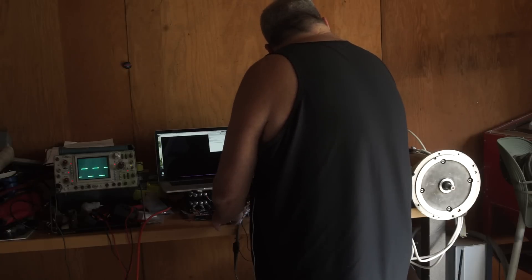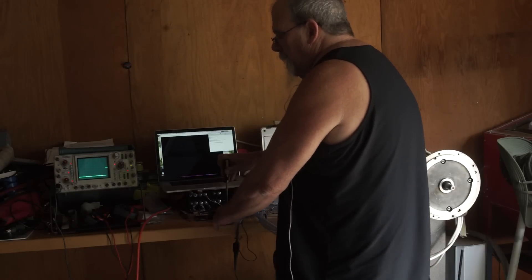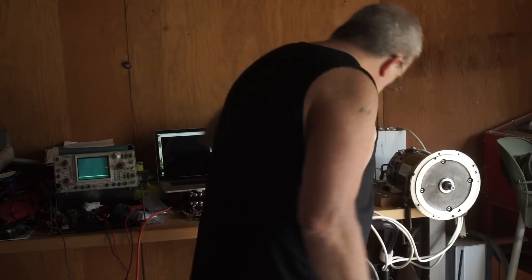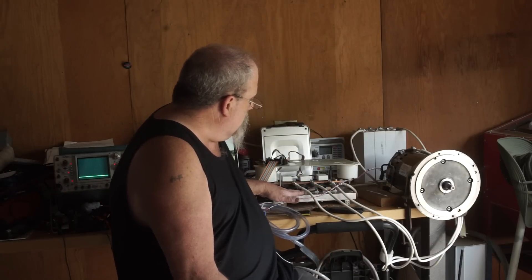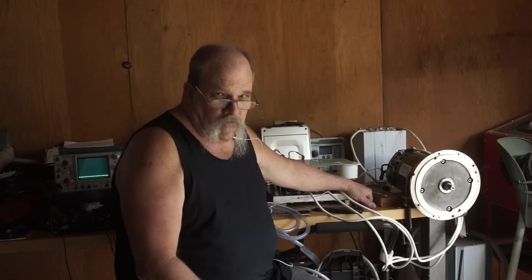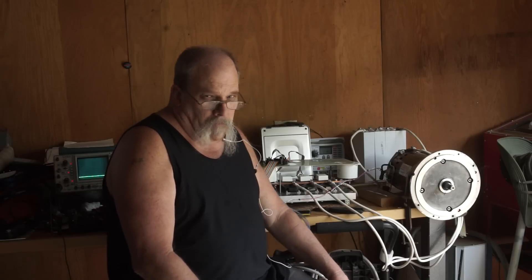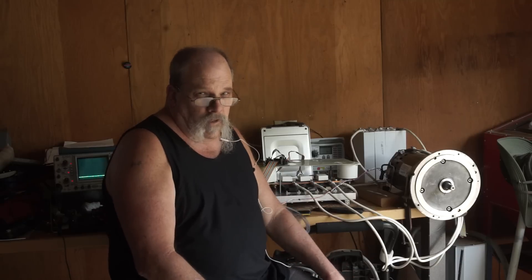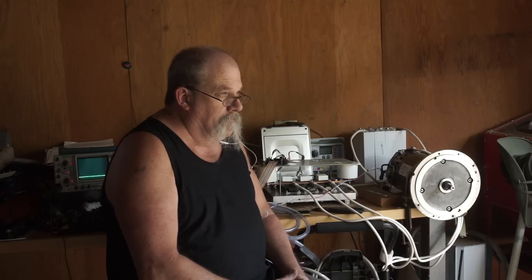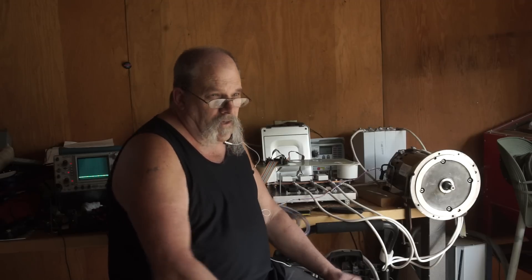Nice clean output there — there's a good speed, and then slow it down. That's what I've been working on. When I ran this thing yesterday just playing with it on and off, it does heat up the heat sink, so if I play with it a lot I'm going to have to hook up the water cooling. I don't have a good pump yet, so I'm going to pick one up — I hear Jack Rickard has a really nice one on his site.